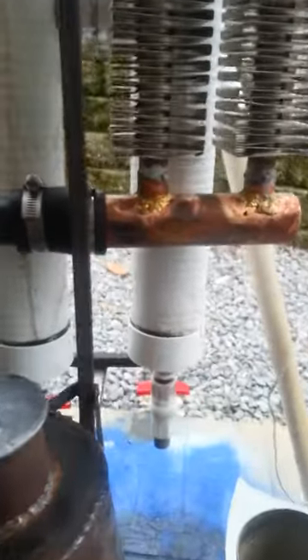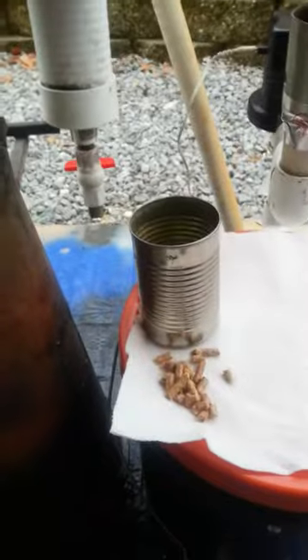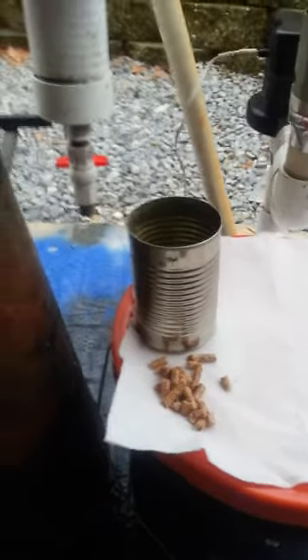The cooler tower still remains, and water seems to drain down into the cyclone. From there it goes to what I call scrubbers — first steel wool pads, then up the tubes for cooling with more water. The far tube is basically scotch-brite, and then finally down to my filter which is full of sawdust.